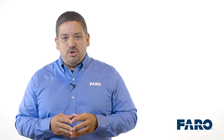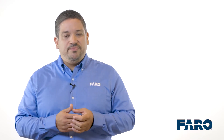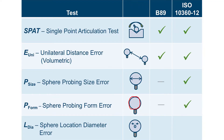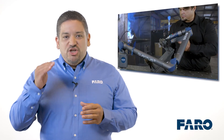This certification process requires more arm positions and numerous articulations of the arm. When we do compensation and calibration, we put the Quantum S through all of its paces. The ISO procedure takes three times longer to complete than B89 due to the additional positions and articulations of the arm. It fully characterizes the performance of the arm through a rigorous process, resulting in a truly shop-hardened, more accurate, more stable, and highly reliable product.